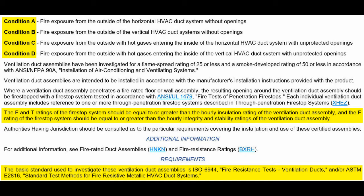Here we're highlighting what the fire stop does, and this is at times misconstrued as being the performance of the entire system, which doesn't do that much that I can see for the air. What is that air like? How hot or cold is that air that's getting into the protected area, into egress routes and areas of refuge, whether the fan is operational or not? It doesn't address those things.